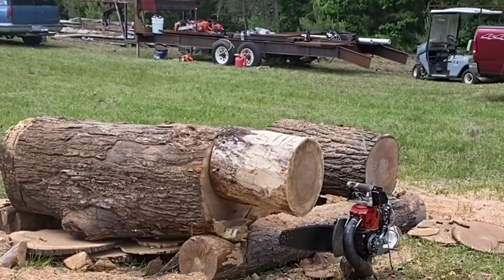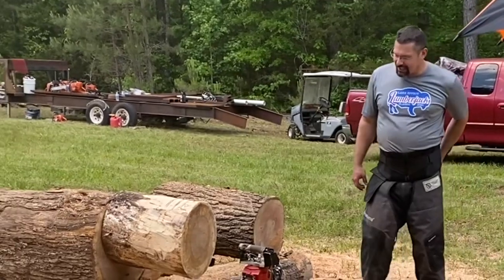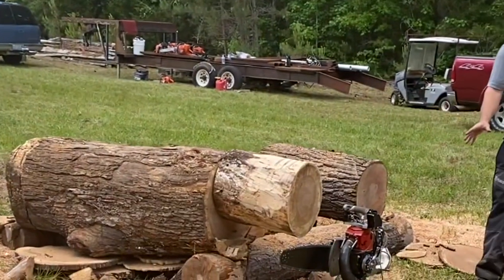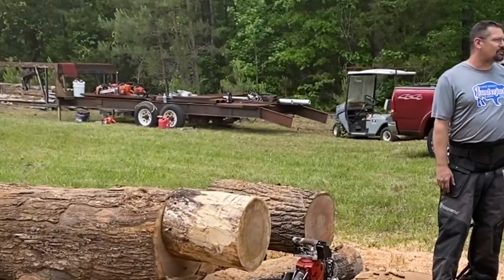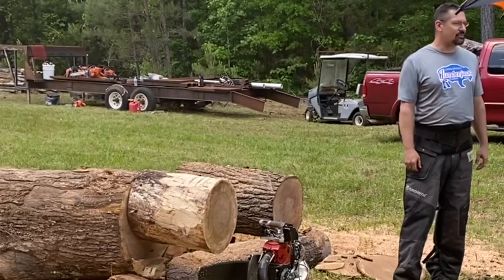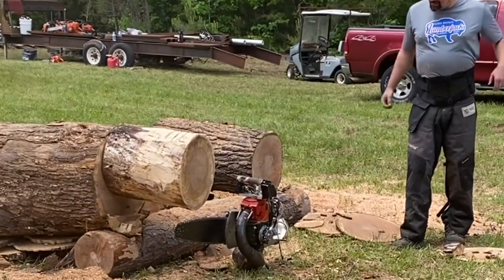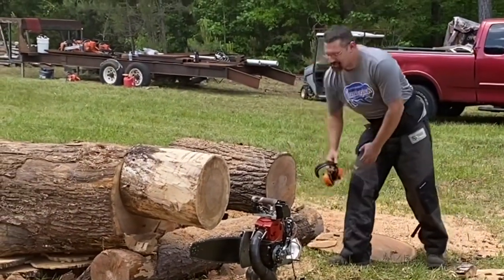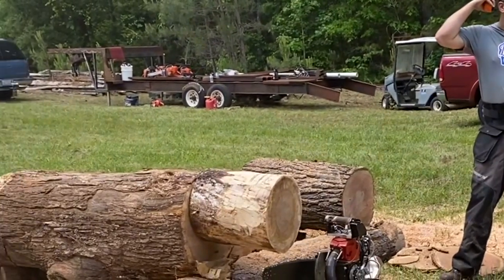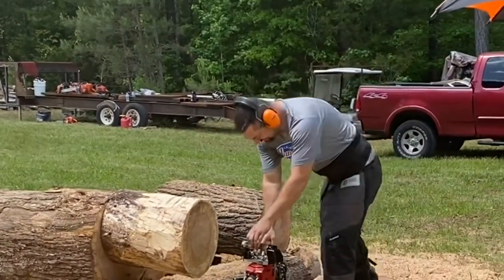Clint Davis did the chain up — he's a guy out in Iowa, does good work on chains. That's just a low tooth, kind of practice chain, but it cuts pretty good. It's still going to do probably more than anything we've got. I've been struggling. The saw's picked up this year a little bit after it broke in. It's really sucking fuel, so I've re-jetted it twice. I'm going to race it today to see if I got enough fuel. If it dies in the second cut, I apologize — it's all test and tune around here.